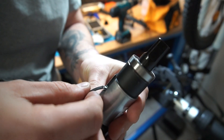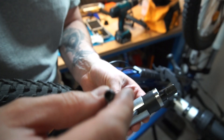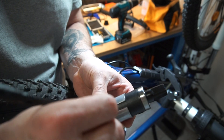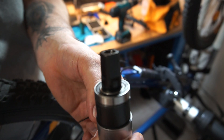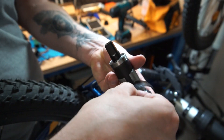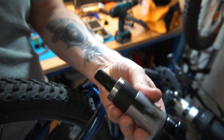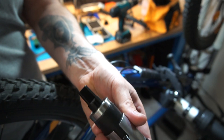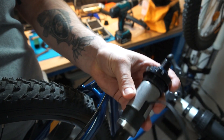I tried to put some thermal tube here but couldn't find a proper piece because the diameter here is 9.5 and what I have is for 10 millimeters, which is not shrinking enough. So I will use a piece of black tape just to be sure I have additional safety cover. We have this additional safety cover here, which I think is important to put on before you nick the outer safety cover of the wire. It is a little bit too thin in my opinion.